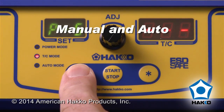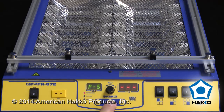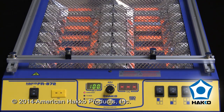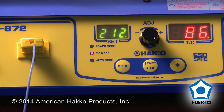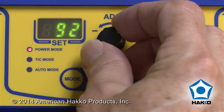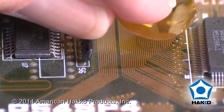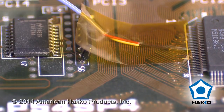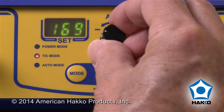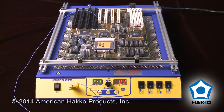Manual and automatic modes of operation, using either the power intensity settings of the heaters or a thermocouple for closed loop feedback of the board heating. When using the power mode, you simply adjust the percentage of heating power you want. When using the thermocouple mode, simply place the thermocouple onto the board, set the temperature you want on the control panel, then press start. The closed loop system will regulate the power to maintain the set temperature.